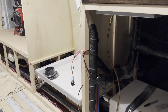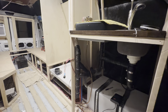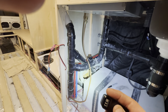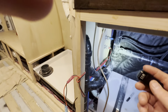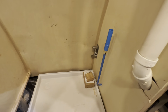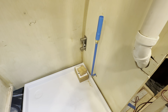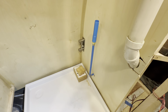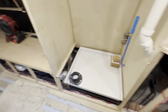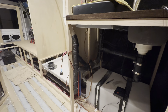In the last video I had talked about how I had most of the plumbing installed. Well, I've actually finished up the plumbing. You can see I brought that plumbing up from here over, and there is the shower valve — it's just in place now, I'll remove it later. This is going to be the water supply to the toilet. I decided not to plumb that one in right now because I don't have the pan in, so I just capped it off when I tested the system. Other than that, everything else in the plumbing system is complete.